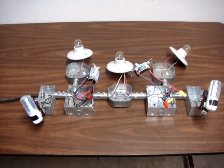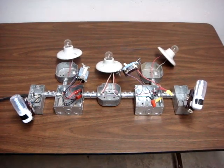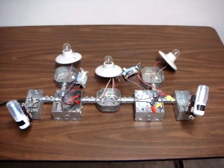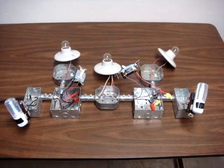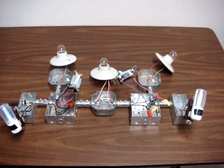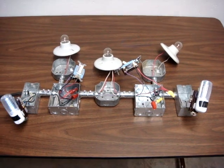This is an unusual three-way switching arrangement. The part that makes this unusual is that you can switch lights on both ends of the three-way switching circuit and have power on both ends. This uses four wires to achieve what it would take five wires to do with the typical three-way switching arrangement.